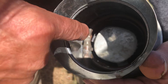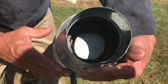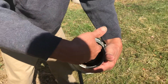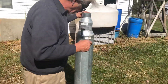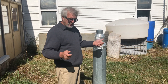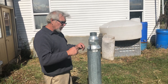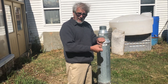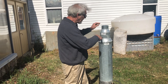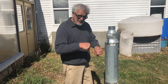We've got fittings — a three inch, then probably a six inch, then an eight inch — just fittings you can buy at one of the big box stores. To coil this copper tubing up, I'll share a little secret: when I bought the material, I sealed up both ends and filled it full of water, put it in the freezer. Then you're wrapping this thing up frozen, so it doesn't kink. When it unthaws, it goes away. If you're trying to get it that tight without freezing it, it would kink constantly. Frozen water was the trick to wrapping that thing nice and tight.